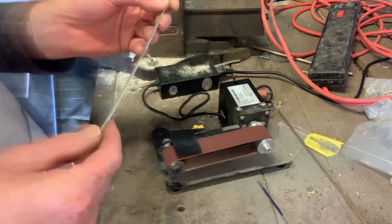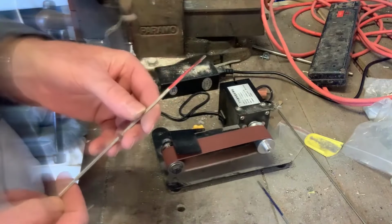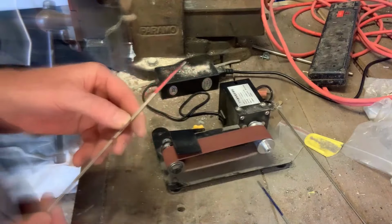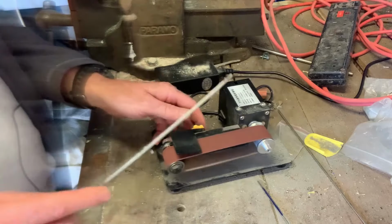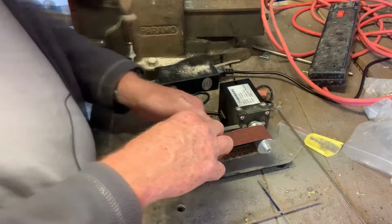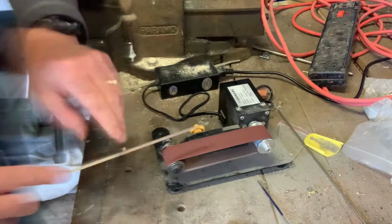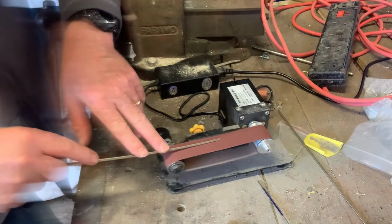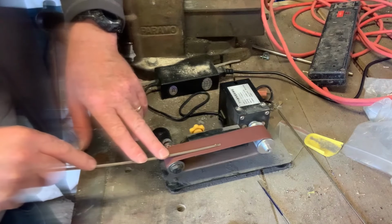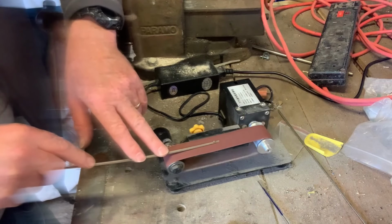So now we have to deal with the switch blades. So this, I've marked one red and one blue. That means one's left and one's right, but they are handed. So now with this, we don't switch that off, and we don't need this little plate. Now, so here we go. A nice gentle stroke. You've just got to take it off so it's just a nice plane.